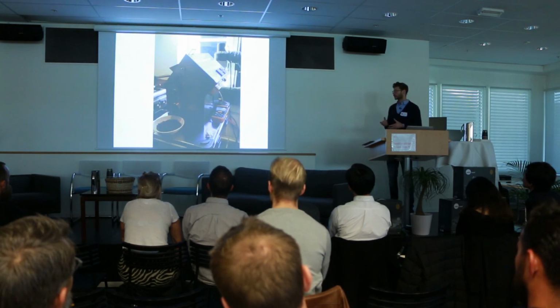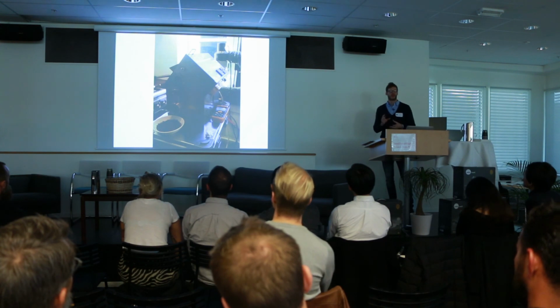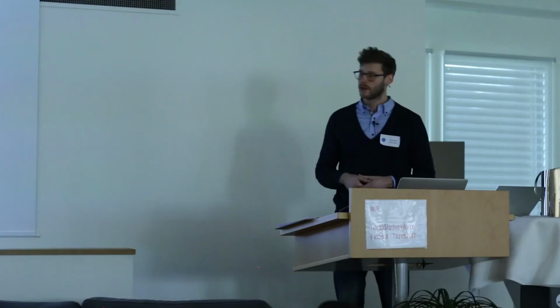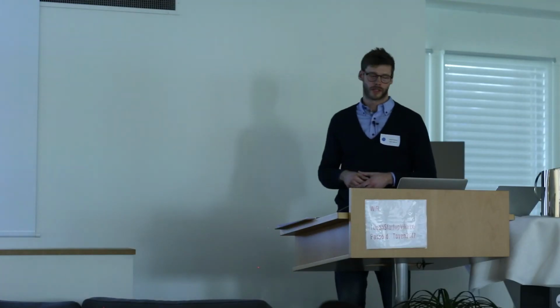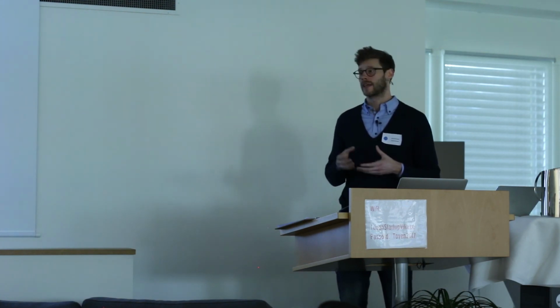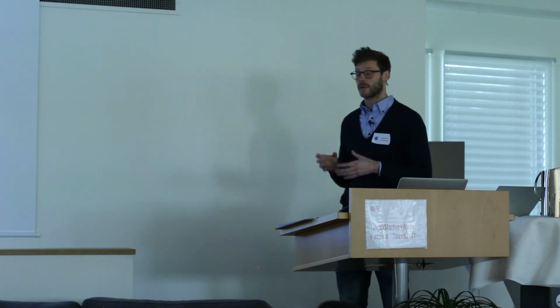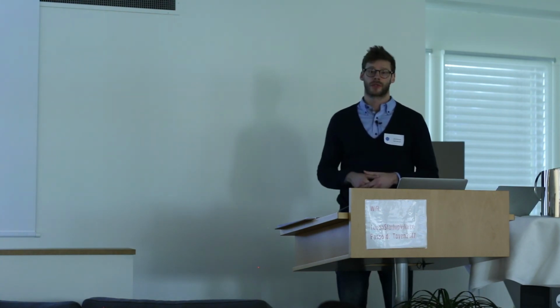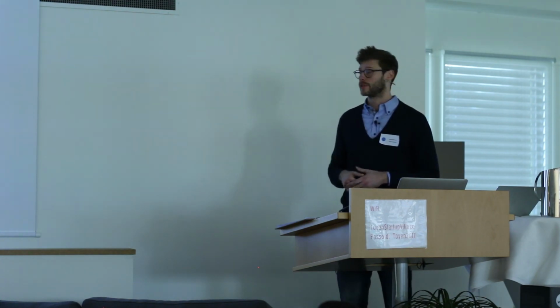So after discarding the double drum, we wanted to test out a new way of making the internal drum of the machine, and this is our first test concept. Here we used a Hoover vacuum motor to discharge the coffee beans and cool them, and that had a pretty impressive cool down time in a matter of seconds. But unfortunately, it did sound like the machine was about to lift off every time you used it.